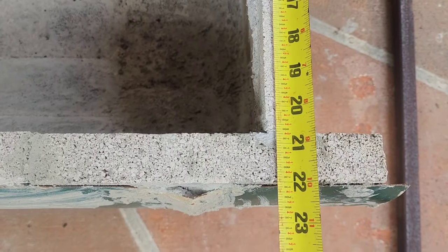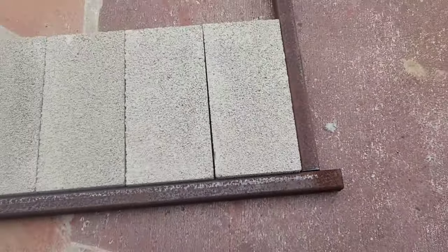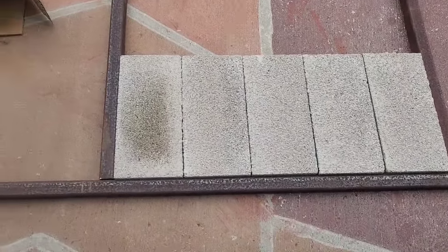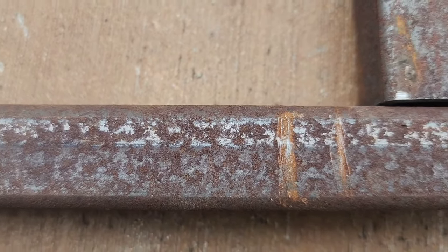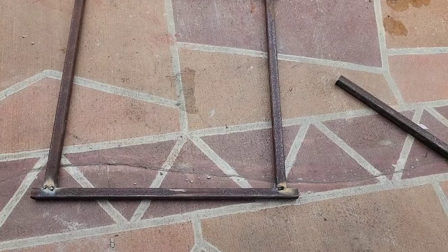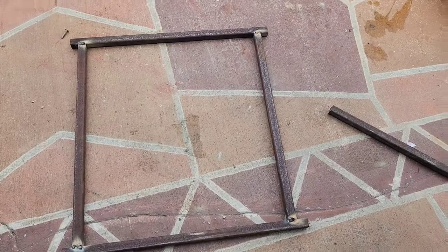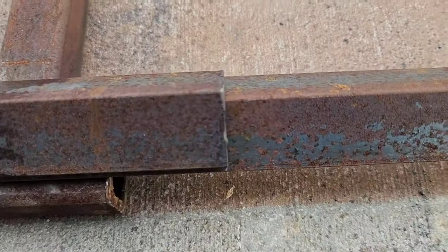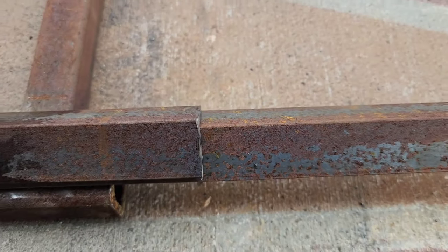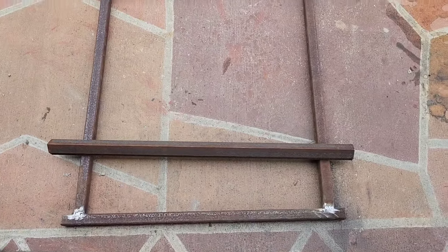Now I'm going to make a table. If you are not making a table you can go for a brick table and you won't need this, but I am making a metal table. Make sure you are cutting one inch extra — so this is going to be two inches because one inch tube and one inch extra. This is going to be around 26 inches wide and to the back is around 27 and a half or 28 and a half inches.